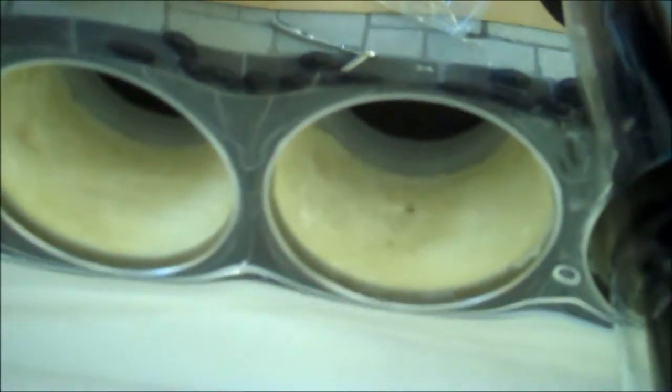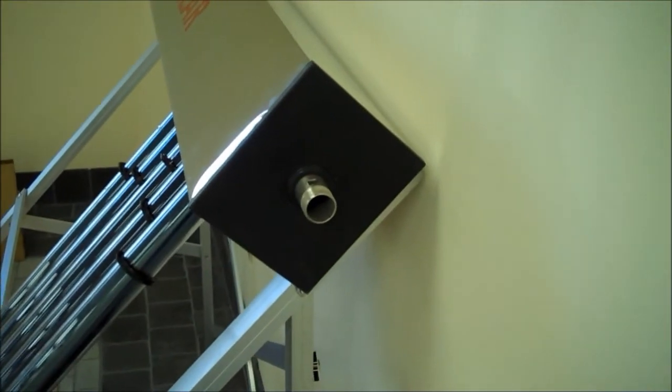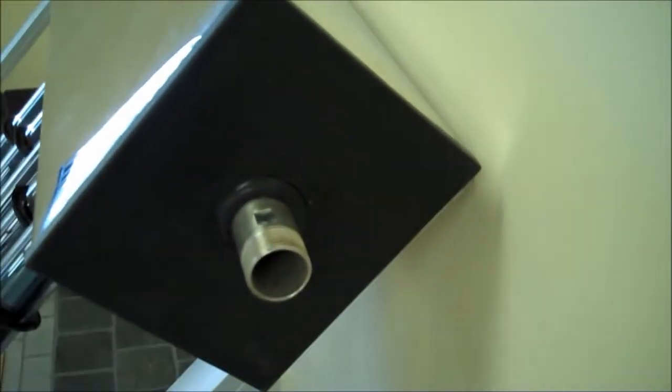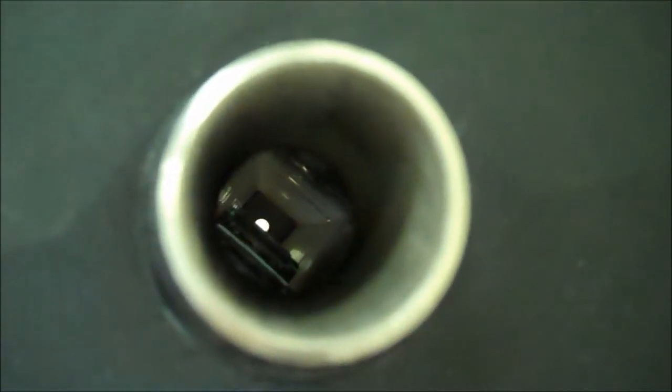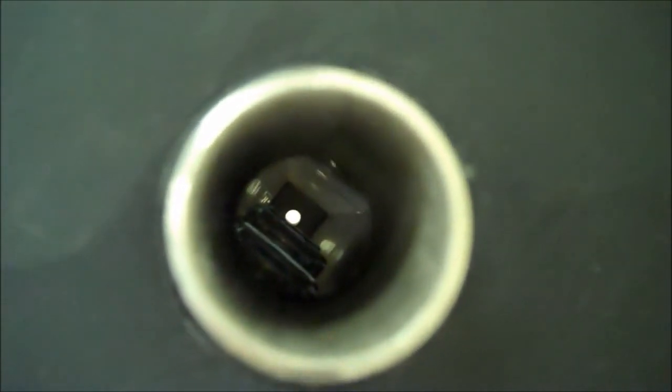As you can see inside the tube, we have a stainless steel outside with approximately two inches of insulation to prevent heat loss, and then a stainless or silicone high-temperature gasket feeding water into a square stainless steel manifold. These gaskets are replaceable. The manifold has one-inch NPT stainless steel nipples for connections. When first installing it, you can see the tops of the tubes and the extra space between the tops of the tubes and the top of the manifold — yet they're still making good contact with the silicone.